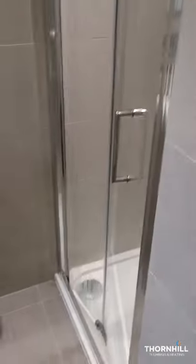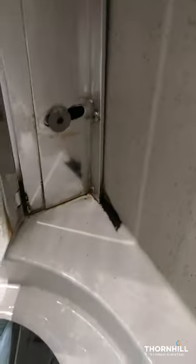There's a watermark on the ceiling directly below the shower - we see it again. There's a gap in the seals; the corners don't look too great, and also behind the profiles.